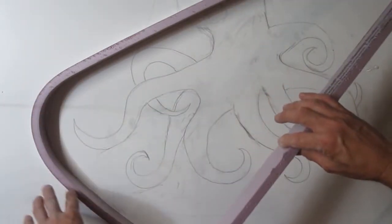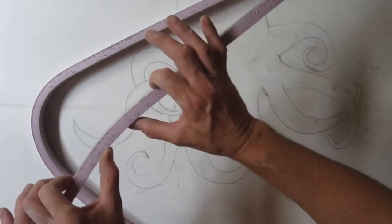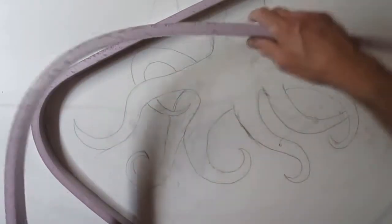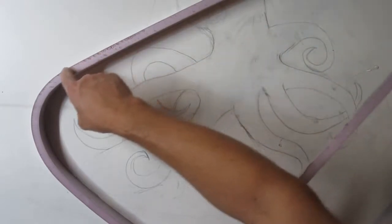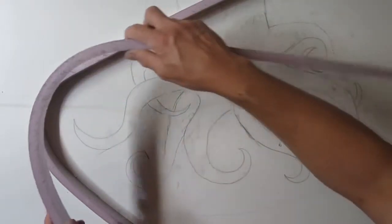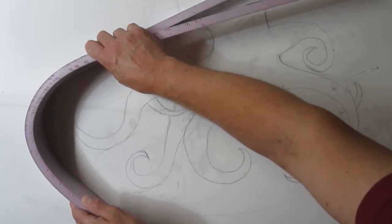So this is my most extreme curve here. You start with the middle, and that's where you're going to bend that curve. If you try and do it at the end, you're going to snap it. You need to do it in the middle. So then you just put a bead of glue around here - not all the way around, just along the curve - bent this into shape, laid it down and wait until the glue dries.